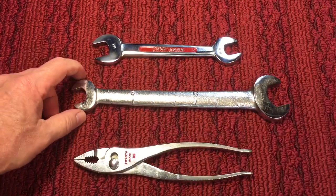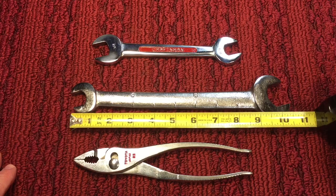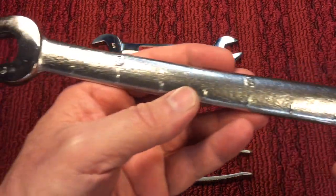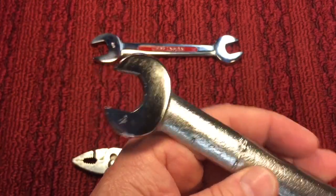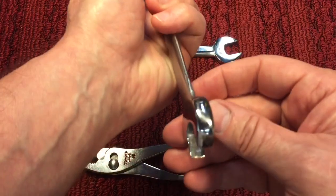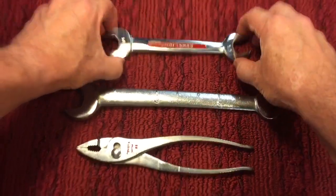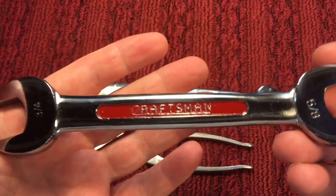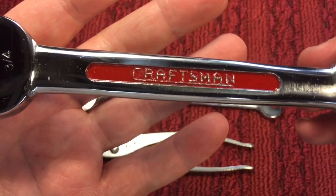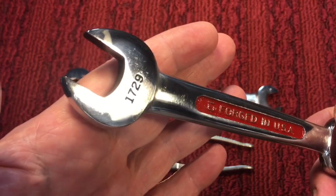Secondly, we did this unknown maker wrench — remember it had the markings or graduations, and they do line up. You can see they are exact to the measurements, so that's an interesting wrench. I couldn't put any paint on there because I thought it would chip off, and I don't like any chipped paint. But we polished out the edges, got rid of the forging marks on the sides, and this is a really nice wrench. Feels really nice in the hand. And then of course our favorite — the Craftsman. Look at this, it's just a pretty wrench. The shape, the size, the design with the Craftsman in the middle. I painted that red in there and baked it on for about three days, then took the top of the lettering off. Just a nice wrench.